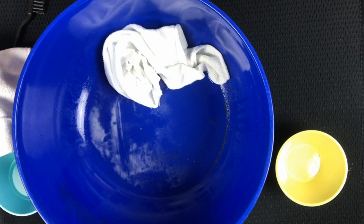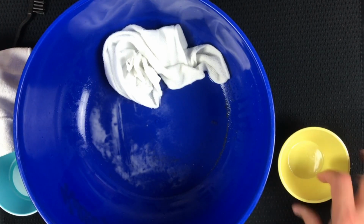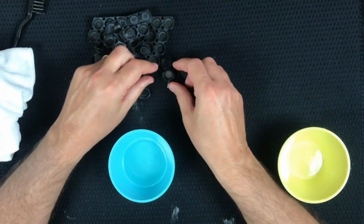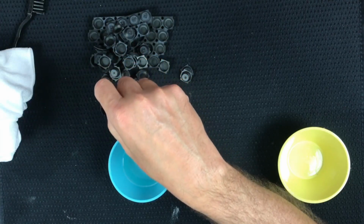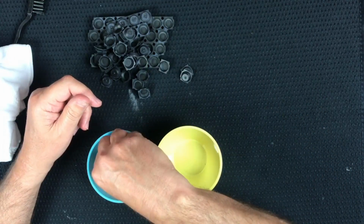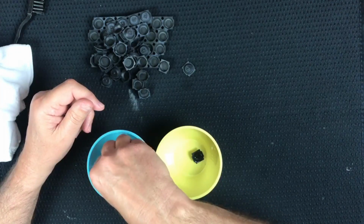Now, let's get back to rubber dome, guys. So, wow, I think you can see the filthy stuff right there, like foam particles. So the question is, how can we clean these domes efficiently? Oh, did I forget? Look, I found one that I forgot to peel. Okay. Well, basically I think I'm gonna do a quick dip and with my fingers just kind of do that, and then we'll put them here, and then I guess distilled water after that, and then drying.